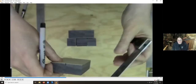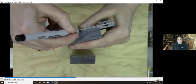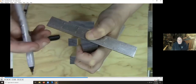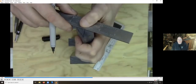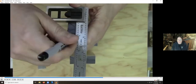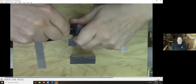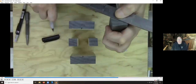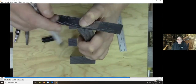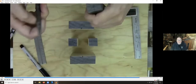The only place the center is actually important is the very center piece of the blank. The center of the rocket has to be the center of this central section — otherwise the pin striping doesn't line up properly and it's not balanced properly around the body of the rocket. So laying out this center section is really quite important. I'm using a center punch to mark it for drilling, because I'm also going to drill locator holes for my drive center and tail center, so that when the blank is glued up I can just mount it on the centers.